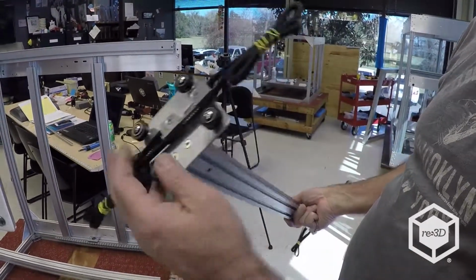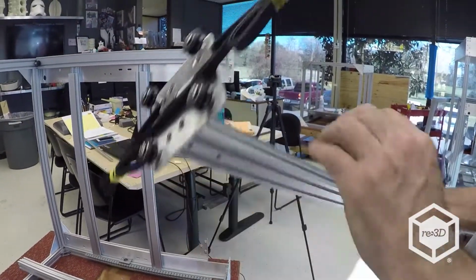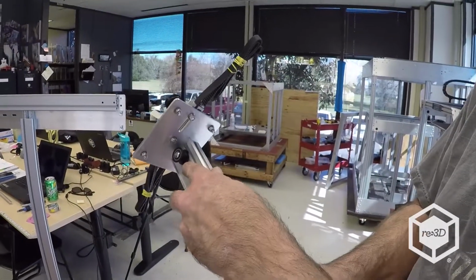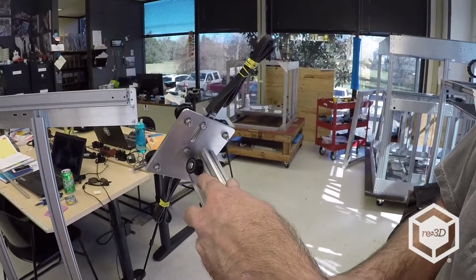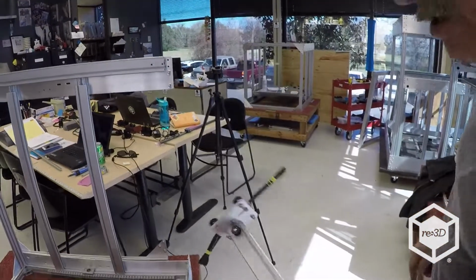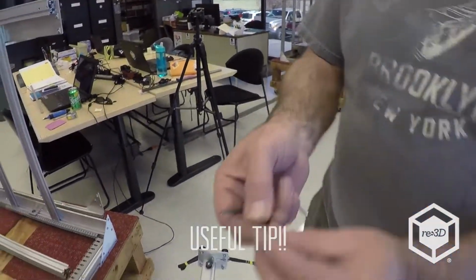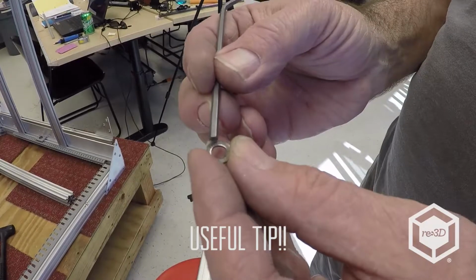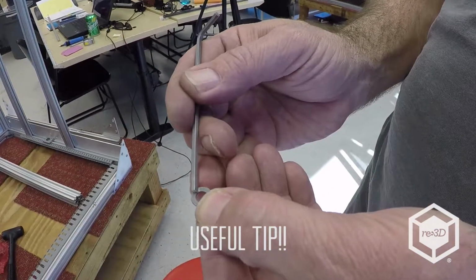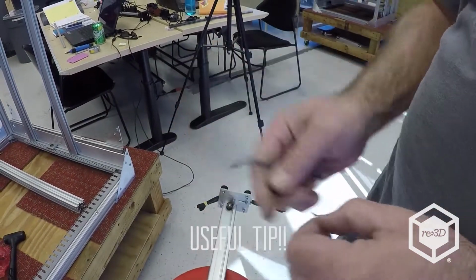the wheels with the eccentric. Make sure you've got grease in between the plate and the eccentric for ease of adjustment. I've got the idler pulley. Same as before, you've got 3 washers with the concave side up on the bottom. Let me show you what I mean about the concave. These are stamped washers, and you can see how you've got a smooth side with radiused edges, and then you've got a flat side. If you put the flat side against the bearing, it'll chew the dust seal up. So you always want to put this surface against the bearing.